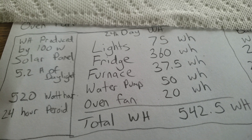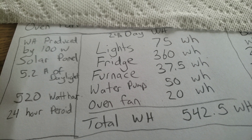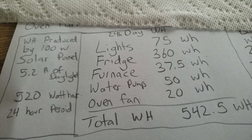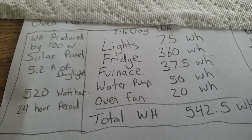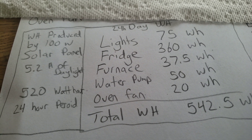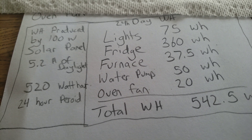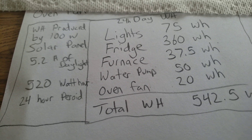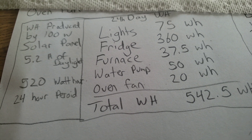Just to make sure your batteries get charged at the end of the day: with my system, I would need roughly 300 watts of solar panels to safely run everything for the whole day. That's a rough estimate. The best way to do it is to start where you think you need and go from there — bring a generator if you need it, just in case. That's a basic way to figure out how many solar panels you need for an RV.